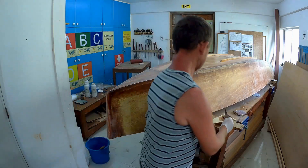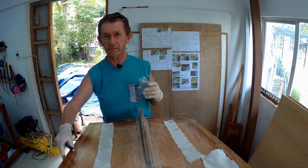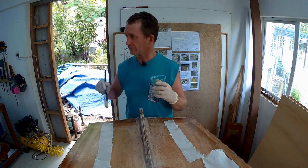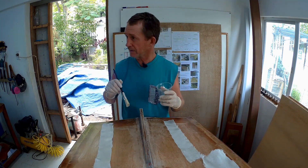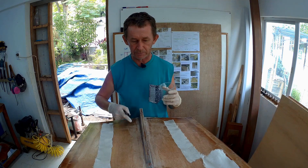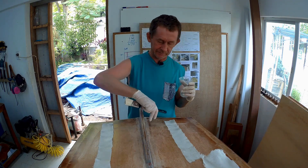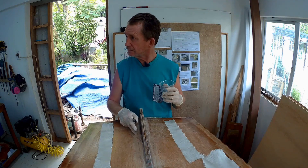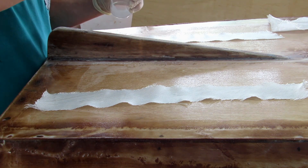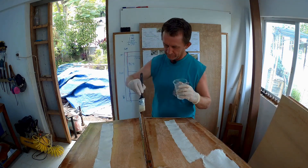Good morning. I've already given this all a second coat and it was much easier to do — it took way less material. It's almost good enough to prime. Now I'm going to do the skeg — I want to fiberglass it in two coats. When you're fiberglassing around corners like this, it's better to do it in one piece from here to here on each side, and then one piece coming over the top, because it's much easier to get around the corners. We'll put the tape in and dab it in like we did before, giving it all a coat around here.